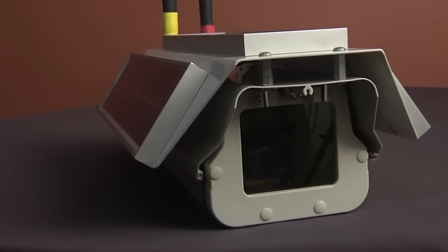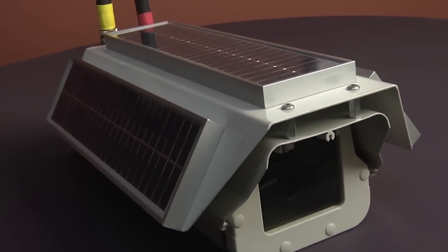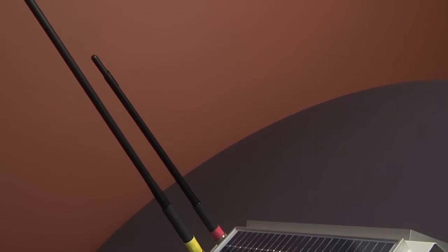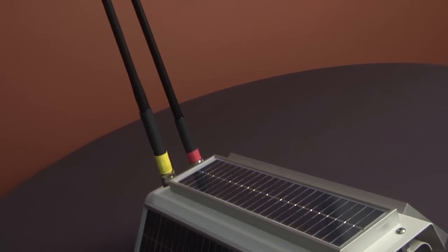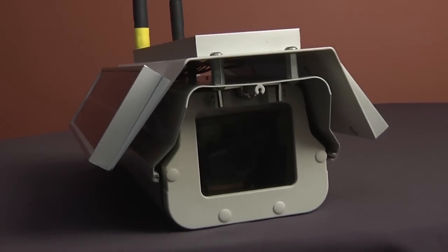Lost video frames mean surveillance in the real-time world doesn't work. The two antennas on the camera: 2.4 GHz is a traditional Wi-Fi band, and our antenna is larger than you'll find on a traditional 2.4 GHz camera, giving it greater range. The 900 MHz antenna is actually designed to penetrate pretty much any material, which allows the camera to be controlled from a distance. That's the big distinction between a traditional Wi-Fi camera and a micropower camera — command from one channel, data from the other.